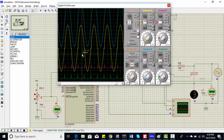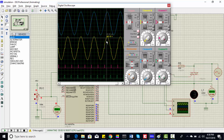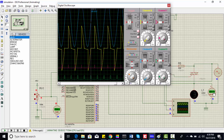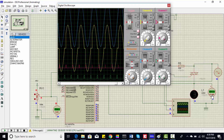Let's run the simulation again. This wave is our power supply wave, and this is the voltage across the lamp through the thyristor. This is the firing angle — right now after the zero crossing the firing angle is minimum because we want full voltage now. This is the zero crossing signal. You can see the voltage across the voltmeter is increasing gradually, and after this the waveform will become full and you will get a full voltage of 220 volts across the lamp.